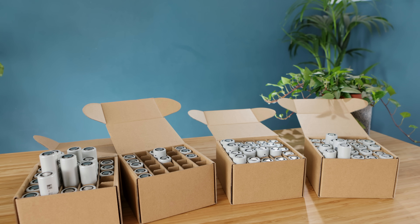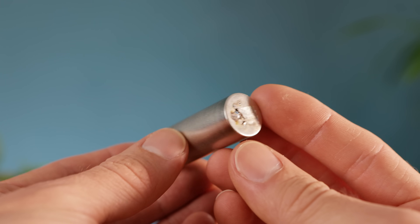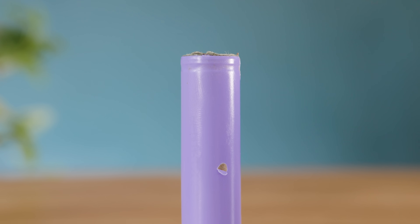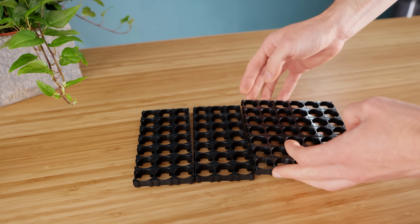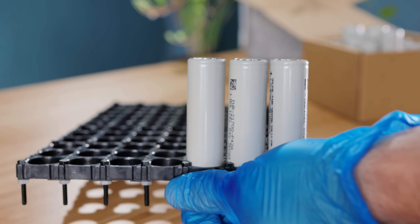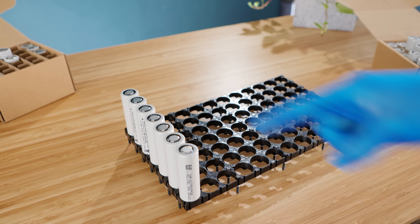With the cells now grouped, it's time for them to be mounted together. You might think that gluing them to each other would be a good quick way of doing this, but it's actually far from ideal — underneath the cell's PVC wrapper is the outer part of its structural cylinder, which is usually the same piece of metal that acts as the cell's negative terminal. If this wrapper were to ever get damaged or worn through, it could expose an adjacent cell to a direct short in a series configuration, which is why this method is best avoided. The solution is little plastic battery spacers. These simply clip together into any desired grid size and keep the cells physically separated by a couple of millimeters, eradicating any chance of them touching and shorting out. This first row is the first of 12, and all of the individual cells in each row need to be the same way around.